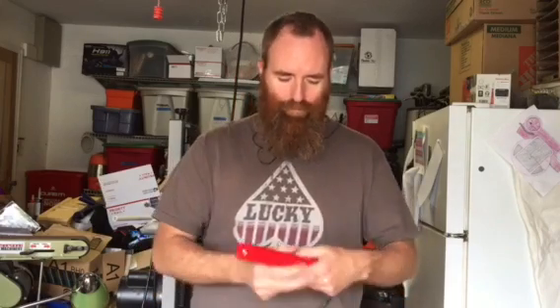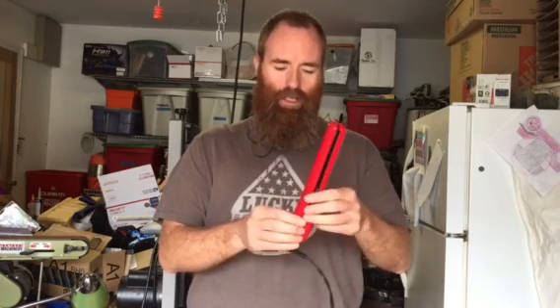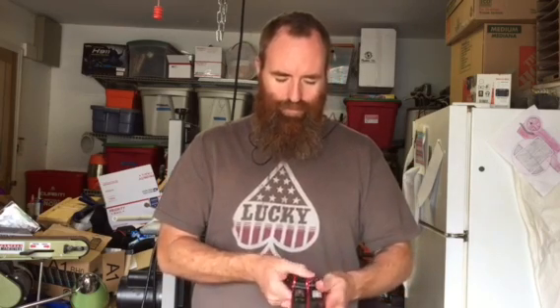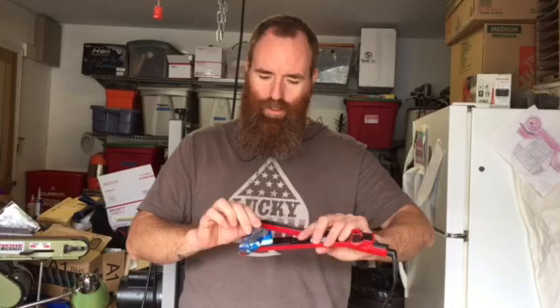What I did — I bought a hair straightener. Got a cheap one, $12, $13, whatever. I took out the hinge pin so it comes apart. This one has nonstick coated pieces and it's got a temperature thermal control gauge that goes up to 450. I go a little lower than that. You turn it on, let it heat up, and then you just stick the parts you want to fuse right on there. They'll heat up and melt — it controls your heat so you only heat up the joint you want to do.